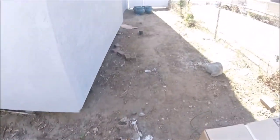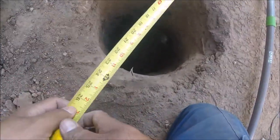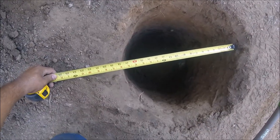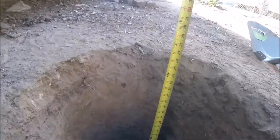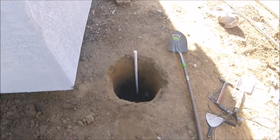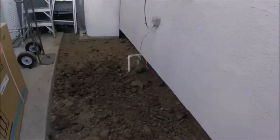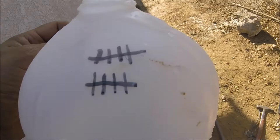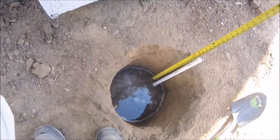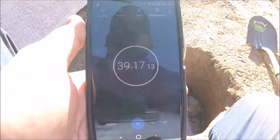Back here is the section where water puddles. What I intend to do is, after I dig my dry wells — which you're seeing right here — put all that dirt back in the area where the water puddles. The hole is over 16 inches in diameter and about 26 to 27 inches deep. I like to stick a PVC pipe in and pull it out in front of the customer so he can see just how deep the actual well is. I poured 10 gallons of water to see the rate of how fast the water was sinking into the hole. Once I'm satisfied that water is soaking into the dirt, I'll fill it up with gravel.